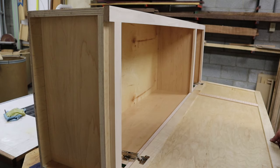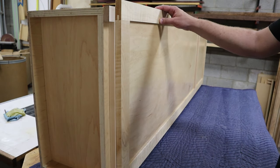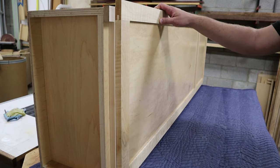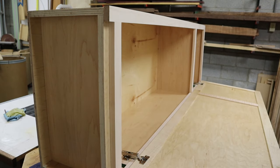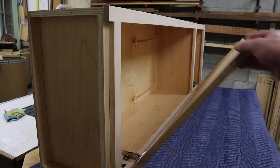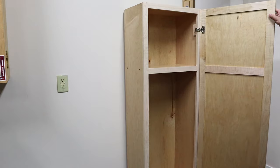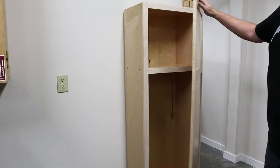Now it was about this time that I realized I had made a mistake. I bought hinges that were for frameless cabinets and I had put a face frame on this one, so I was using totally the wrong type of hinge — and you can see how badly the door lined up with the cabinet. So after a quick trip back to the store to get the right hinges, I got the door installed and adjusted correctly.